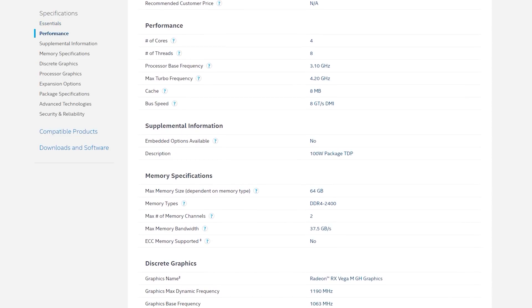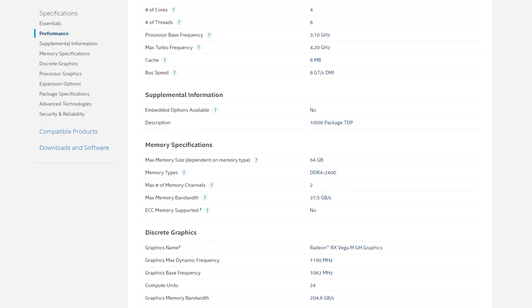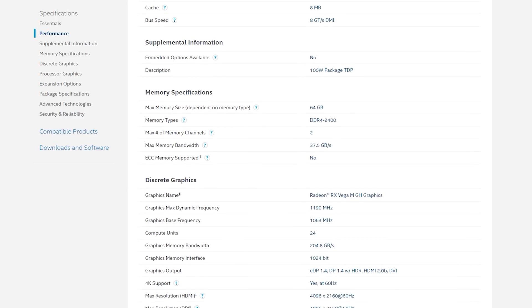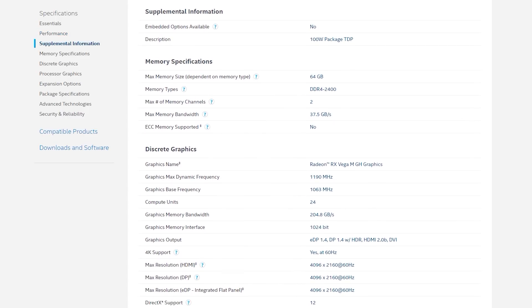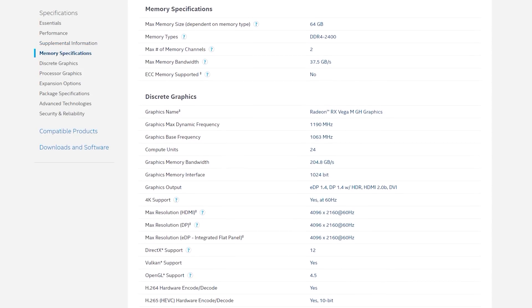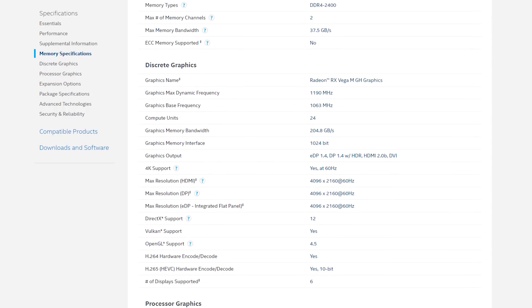The biggest inclusion is the AMD Radeon RX Vega M GPU with 24 compute units, a base clock of 1063 MHz and a boost clock of 1190 MHz, paired with 4 gigabytes of HBM2. This all fits within a 100-watt TDP, and there's even Intel integrated graphics for low-power tasks when the AMD GPU isn't required. Kaby Lake G is specifically designed to provide decent levels of graphics performance paired with that Intel H-series quad-core CPU on a single package, so that OEMs building laptops and small form factor PCs have a single integrated compact solution capable of 1080p gaming.